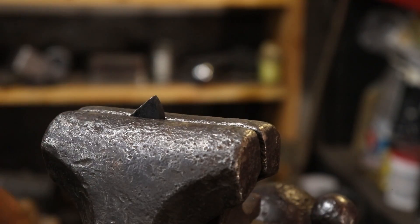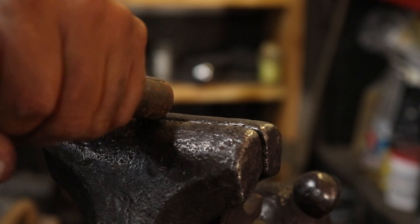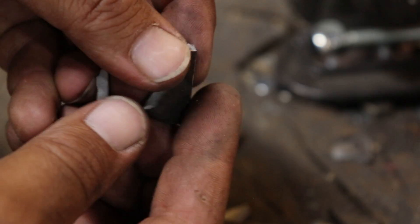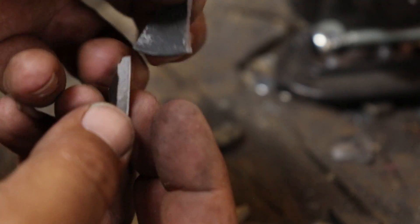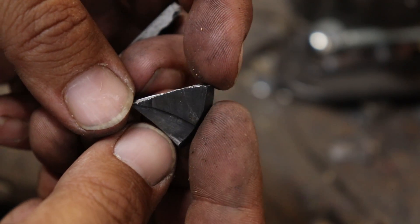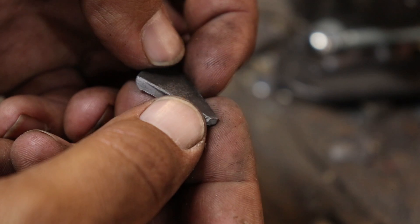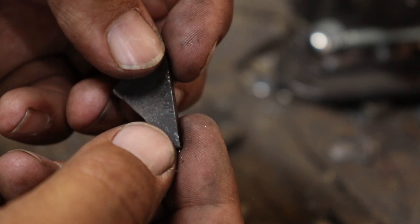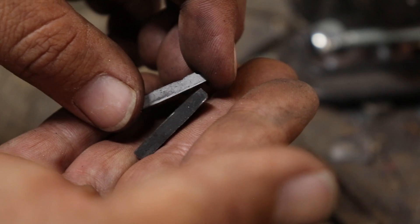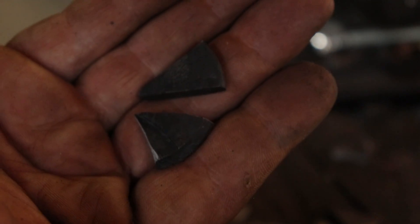On to the inch and five-eighths. It's a pretty clean break. I'm going to try it one more time just to make sure it's consistent. The inch and five-eighths broke pretty clean — it didn't shatter like it did last time; it broke into pieces wherever it was struck. So what I see from that is that this thing is oil quenchable and it's got a pretty good cross section. I'm pretty positive that this is a decent steel to work with. Not for knives, but for tooling I think it's pretty decent.